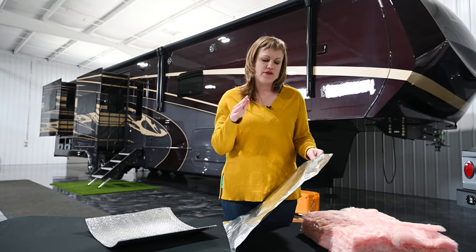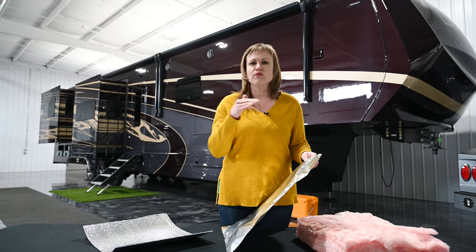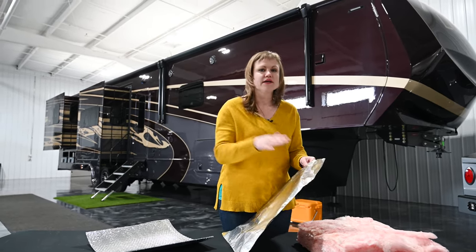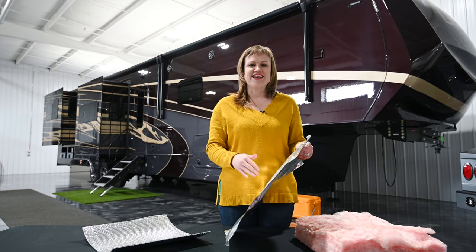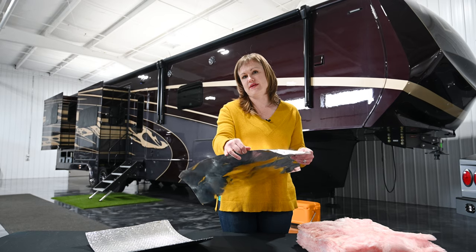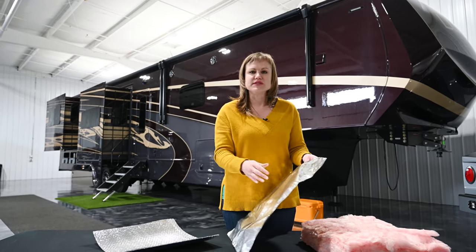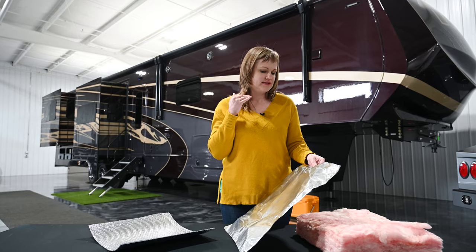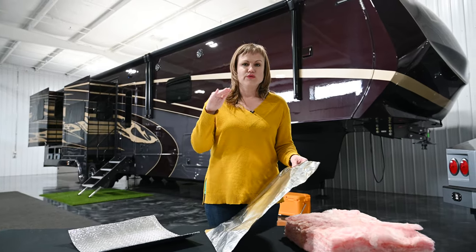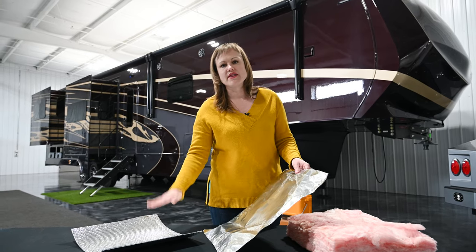Some other manufacturers, if you took all of the different layers and what they use and the R value of their insulation batting, and deducted what they claim this material is — they're claiming that this is an R29. The manufacturer of this type of material would actually say that it doesn't have any R value. You gain that R value by utilizing a dead air space next to a reflective material. That is how it works.